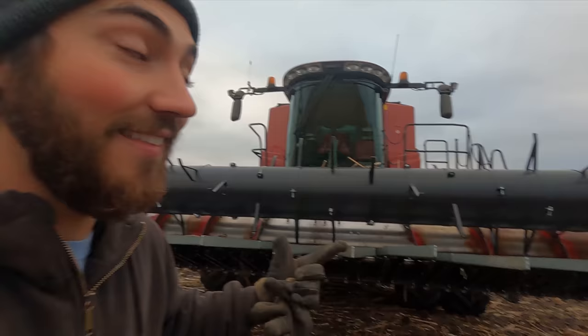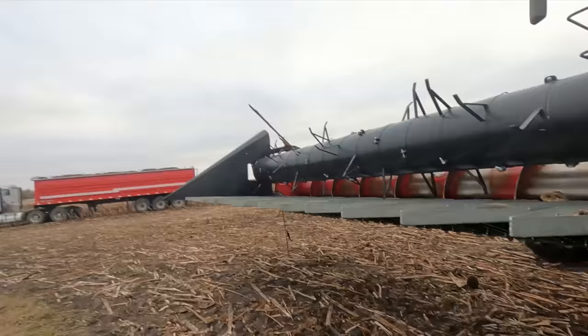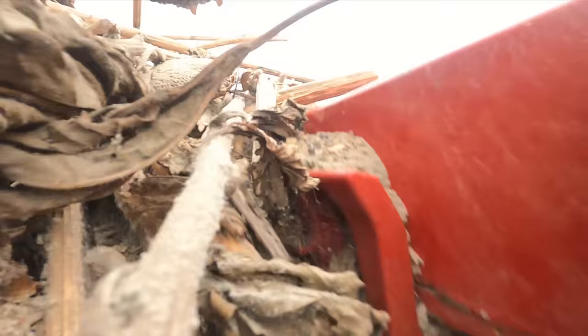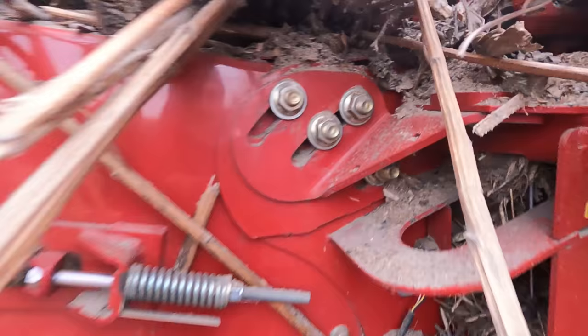This thing eats some seed. The sunflower pans were faced down so far I could hardly see them — my head was up in the top of the cab and I could barely see the tips. It turns out we needed to adjust our feeder house faceplate so that the sunflower header was running a little more level. The faceplate bolts are right on the side of the feeder house — it got slid all the way forward so we got that faceplate tilted for a better angle on the header. And this is the bracket that was broken. But we got her dialed in now and we're combining sunflowers.